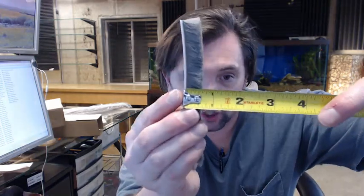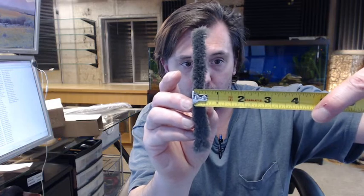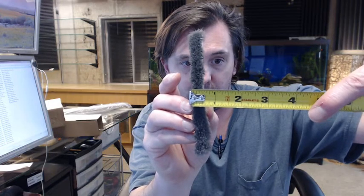The projection of the pile — and the reason I am giving you these dimensions is because people need replacement pile only but aren't sure what extrusion they have, it may or may not be Dorbin. The projection of the pile only is coming in at 5/8ths as you can see. The width of the pile, without crushing it down, is anywhere from 5/8ths — about a half inch on average — is going to be the width of this pile.